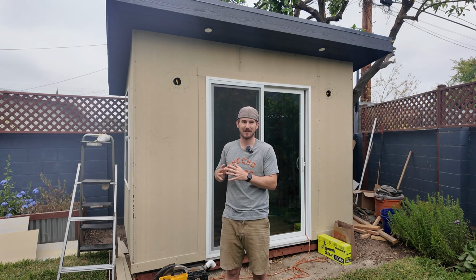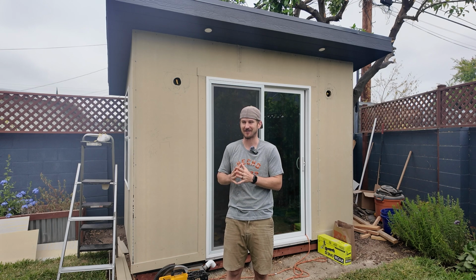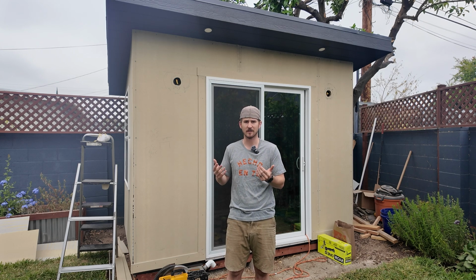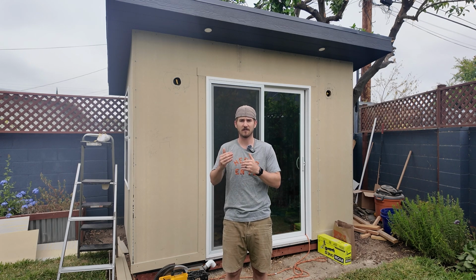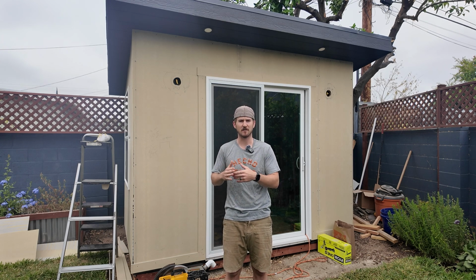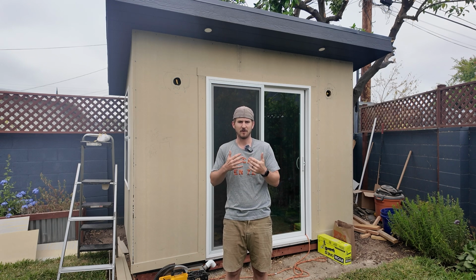So this part of the project has been incredibly taxing on my body to actually complete as a solo person doing the project. For the battens, you can really do whatever you want. You can custom create the widths that you want. In my case, I created 2.5-inch and 3.5-inch width ones from bigger pieces of board. You can buy them prefabricated. Sometimes they are thicker products, so if you want more contrast between the board and the batten, you have that available to you. It does get pricey the thicker the material you get, both from an overall depth and a width. But if you have the tools and the capabilities to create your own, it's definitely cheaper to do.